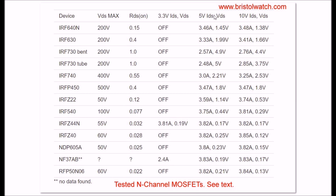Now let's look at 5 volts - some interesting things came up. Notice the voltage ratings: 200, 200, 200, 400, 500. If it's a higher voltage MOSFET, even at 10 volts, the drain-source voltage is around 1.8 to as high as 4.4 volts, even with the gate pretty much all the way turned on. Higher voltage MOSFETs will have a higher internal resistance than the lower voltage MOSFETs. I have not found an exception to this rule - if there is one, please let me know.